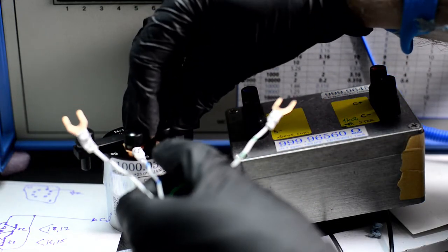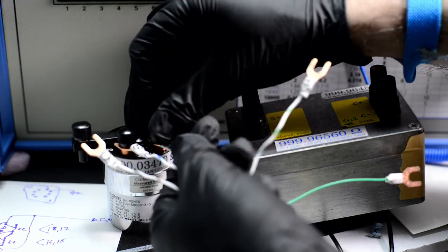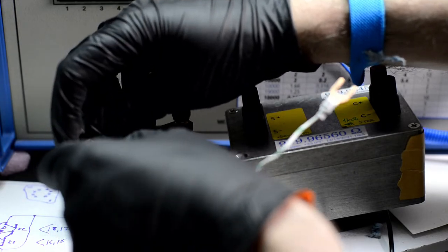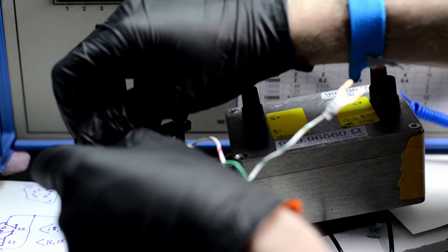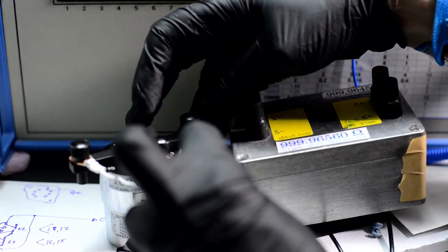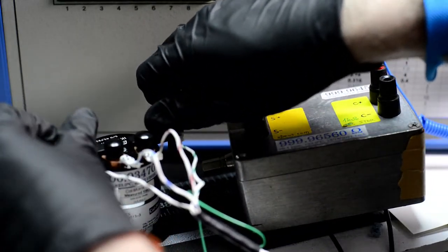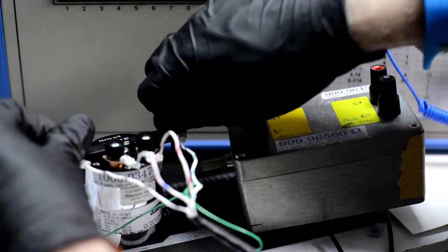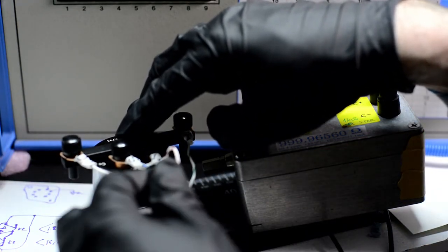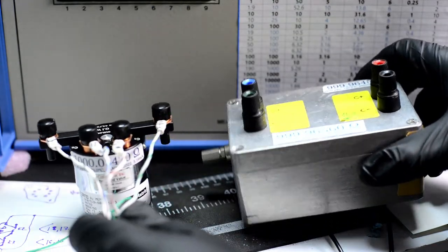but let's connect this resistor. So we have the sense terminals, it's all 4-wire connections, and the current terminals. And this is Teflon insulated wire. So it has very high resistance insulation, but for these values it's not super important. But when you're going down to all those digits, even a few gigohms of insulation may affect your results. So you would want to have good insulation wires in here.